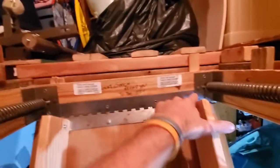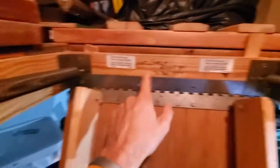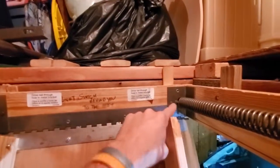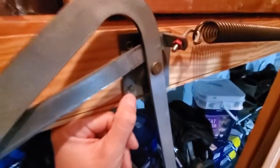This one actually is put in right — they actually use the right nails. We've got 16D nails here, and I thought that was kind of neat. We're supposed to be nailing through these metal brackets here, and also on the pivot plates, which this one is.